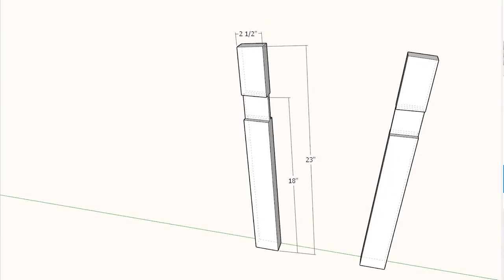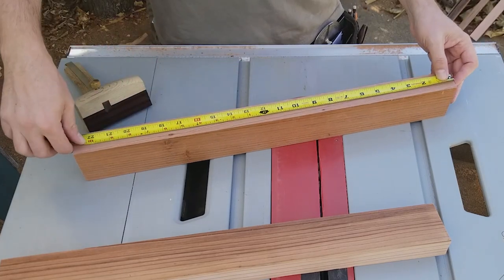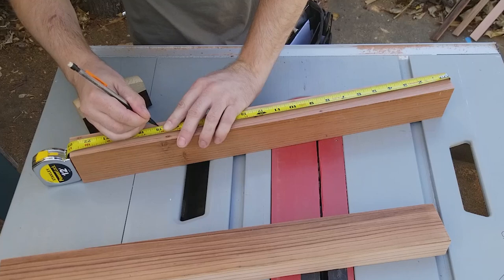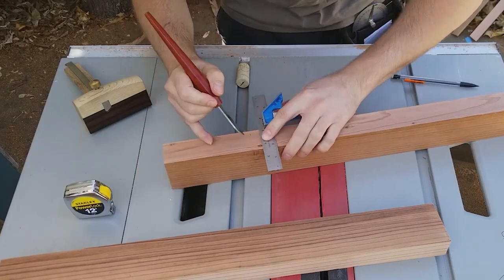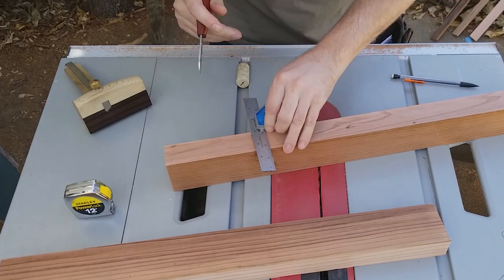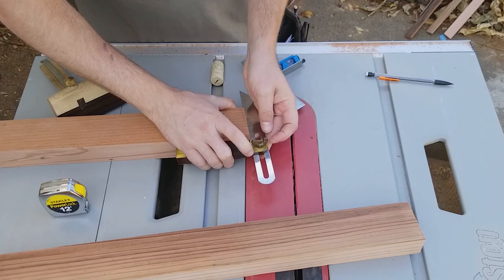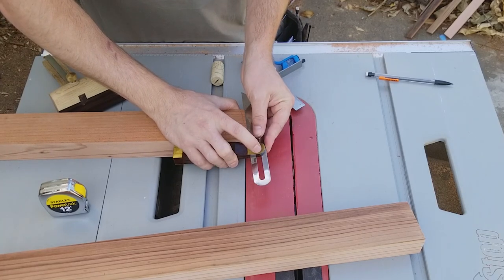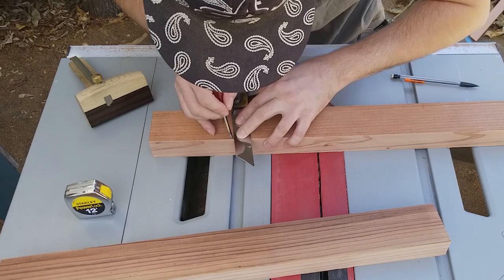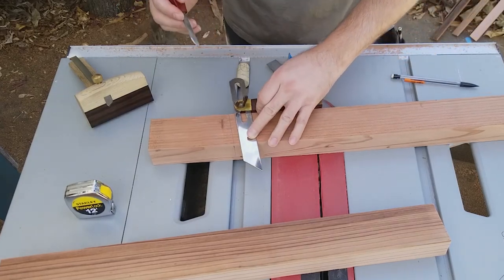Because I want the pot to sit 18 inches above the ground, I measured 18 inches up from the bottom of the leg and made a mark. Then I placed a knife in that mark, butted my square up to the knife, and struck a line across the edge. I took out my bevel gauge and locked it at 85 degrees using the angled end of the leg as a guide, and I cut a line to meet up with the previous one, marking the angled top shoulder of the bridle joint.